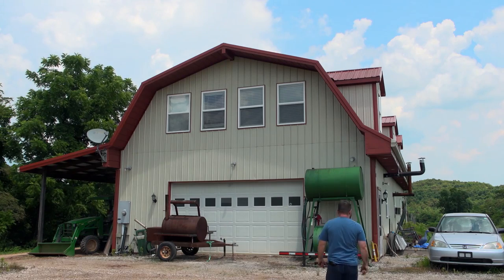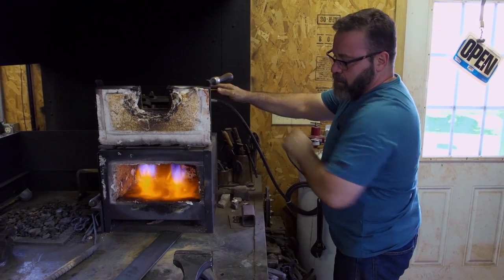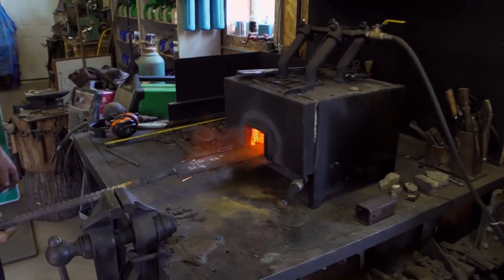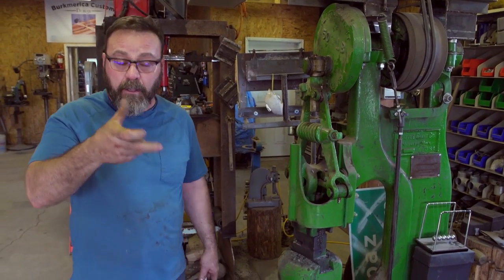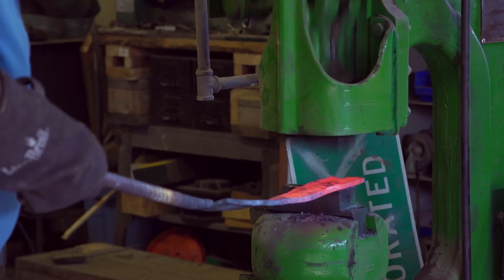So it's day one in Belleville, West Virginia. I got a Spatha to go make. Let's get crack-a-lackin'. I'm gonna be using 5160. It's a forgiving medium. It'll bring some strength to whatever they're gonna smash, cut, break, kill. So I'm gonna try Big Sexy first to bash down the width of that material to about 2.5, 2.25 inches wide.